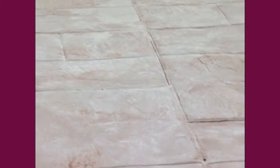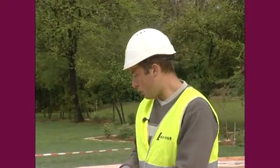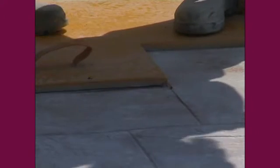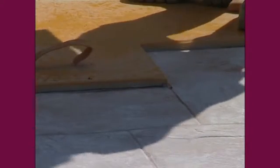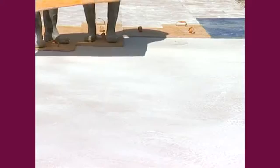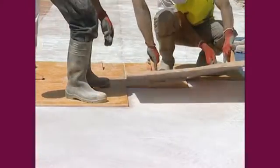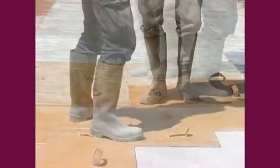What's also important when you lift the molds is to lift them as flat as possible. The aim is to avoid creating spalling in the corners of the molds. When moving the molds, you always take the one furthest back and bring it forward to place it against a mold that is already in position.